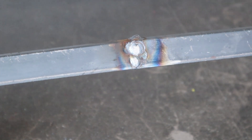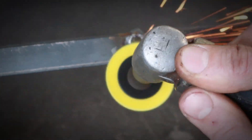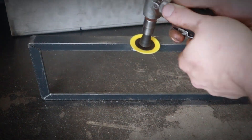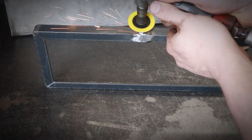Just a little tidbit — we're going to start welding now. Just got done with most of the framing for the tank. Now I just have to weld that together, put a center brace in, cut and measure after I get the frame welded together, and then put a couple of stands on it. When you're a not-so-skilled welder, you can look like an amazing welder so long as you have a grinding wheel.